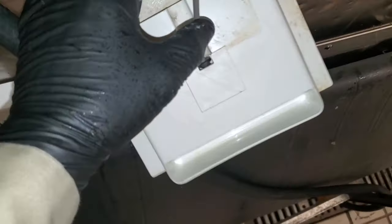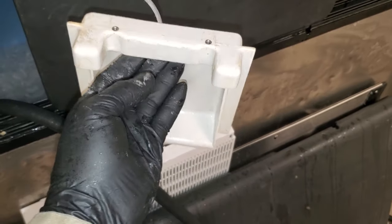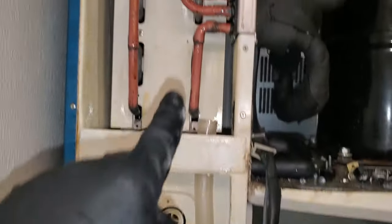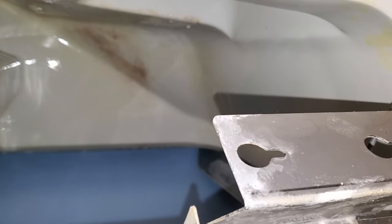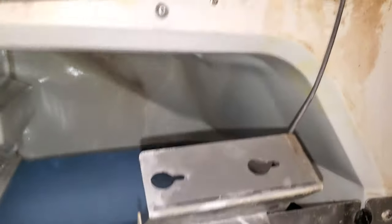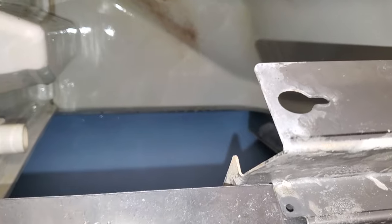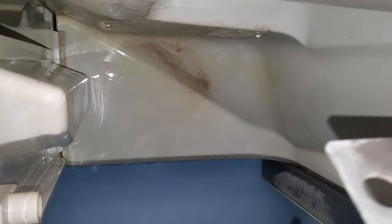You really got to watch out because this rubber o-ring is coming loose, so you cannot submerge this in water. If you submerge it when the o-ring is coming out, then water is going to get in there and mess with the sensor, so we're just going to do a very gentle job of cleaning this. Sometimes these things that are supposed to be submersible aren't, so you really got to watch that. You can use a soft bristle brush or a Scotch-Brite pad as a last resort — you really don't want to use Scotch-Brite or anything sharp if you don't have to, but sometimes you've got to do it because they don't do normal maintenance.